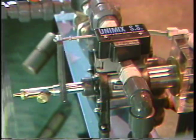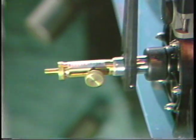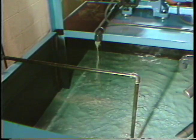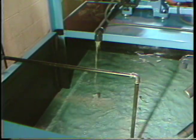Our Zybex system engineers have designed your Zybex batch style equipment to automatically fill the clean tank with a predetermined amount of fresh makeup coolant. The concentration of this makeup coolant can be adjusted automatically to provide new coolant that will combine with the recycled coolant to optimize your system at the proper concentration.